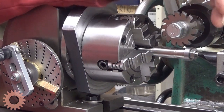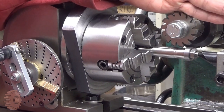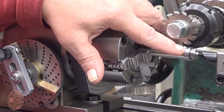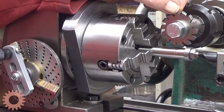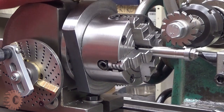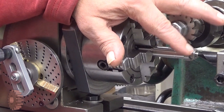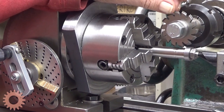And then we have a tailstock supporting it. Then I have adjusted this cutter to the center line, and furthermore I touched the surface previously, and then I moved it to here, and now the cutting depth will be 2.166 millimeters. I could dial that in with this, but actually it's pretty near. I'm running this 100 revolutions per minute, and I'm feeding 20 millimeters per minute, which is rather slow. But I want to have a decent surface finish with this, so that is the reason for a very slow feed. Well, I think we are quite ready to go with this one.